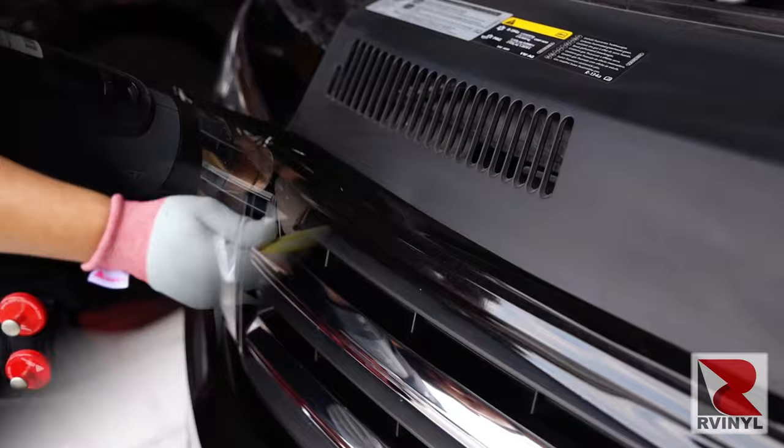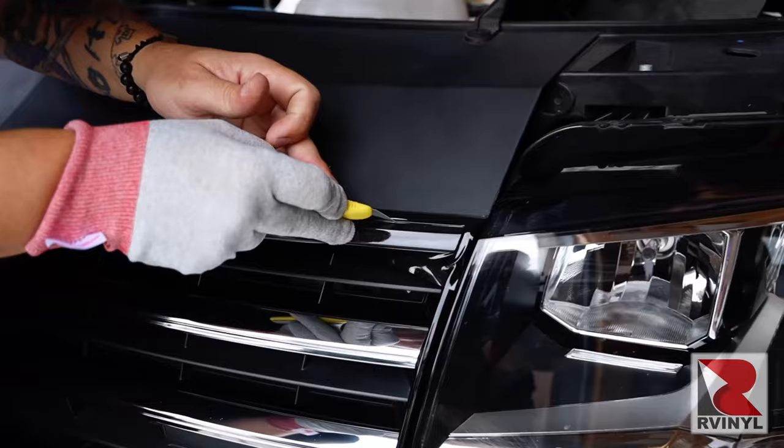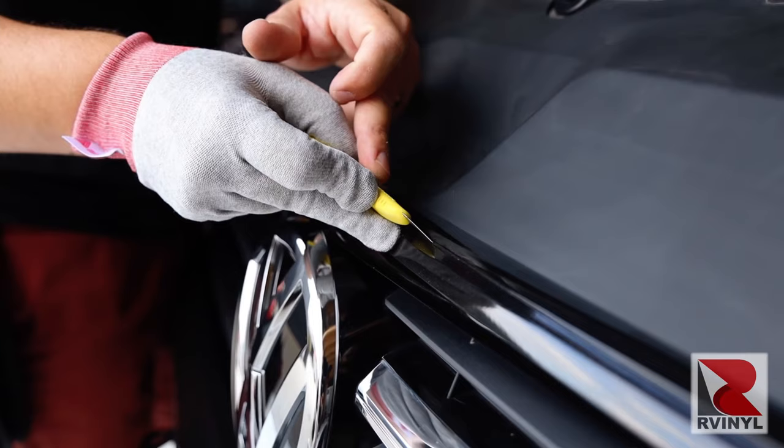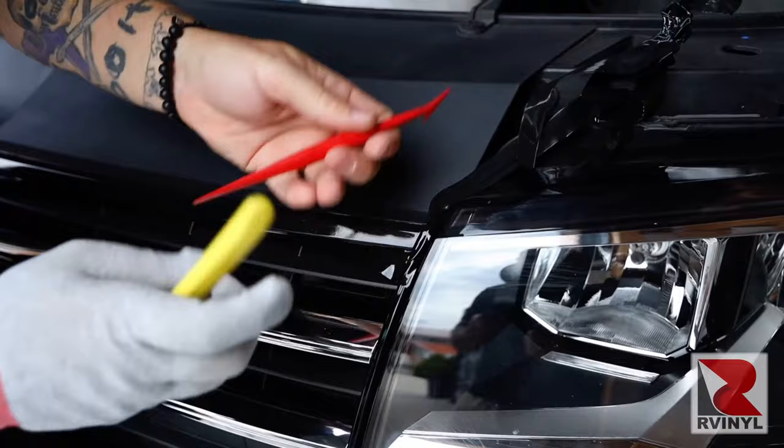Click the blade so it's extra sharp. On the top section, because this is a tight gap, make sure the blade is at the right angle — in this case around 45 degrees. If done right, the edge will hold the blade and keep it from jumping off. Apply light pressure. For the vertical sides, always use the tucking tool to make sure there's even tension and full coverage, then cut the material safely away.